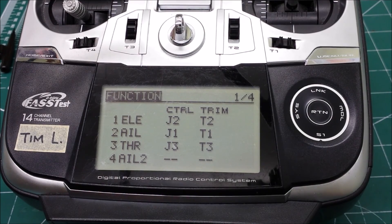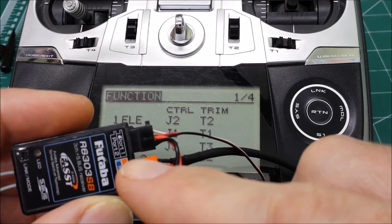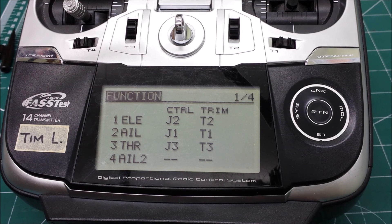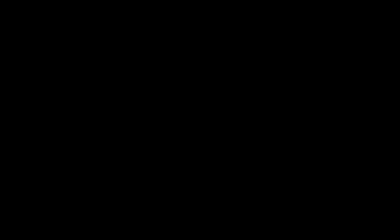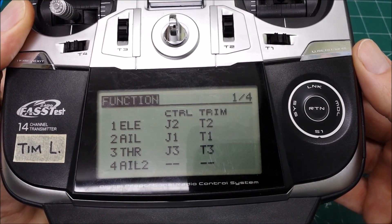One thing I wanted to mention quickly: I have my receiver pack connected to port 2 in the receiver. Port 2 is a vacant port and corresponds to channel 2. As I said earlier, I have the primary aileron on channel 2 and the other aileron on channel 4. As long as I have the decoder programmed correctly for one of the ports to operate channel 2 and one port to operate channel 4, the ailerons will work correctly. If I wanted to, I could put aileron 1 and aileron 2 on channels 5, 6, 7, or 8, or any other channels, but as long as the decoder is programmed correctly the ailerons will work as intended. I have channel 2 programmed to aileron 1 and channel 4 programmed to aileron 2, so now I have to program the decoder accordingly.